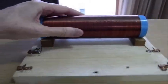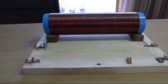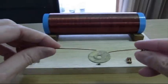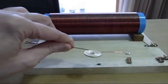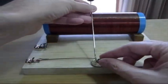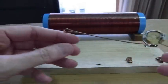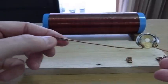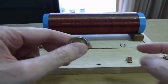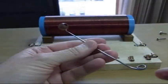The wiring from here to the wiper and then over to the first clip on the diode is the only tricky part of the wiring. I took a piece of copper wire, made a loop on each end, and soldered it to this brass washer. The wire will go from here, be screwed down right here for the wiper, and the wiper will go on like that. I was trying different types of loops to see which one would work — that'll be the connection from here to here and to the wiper.